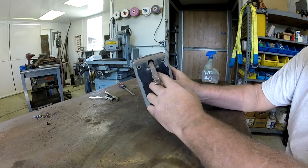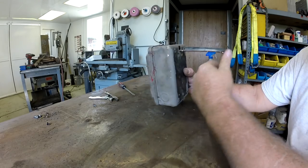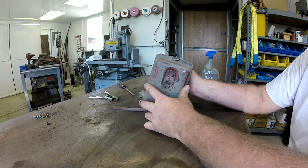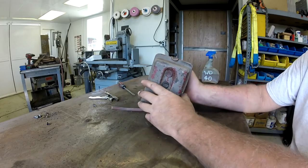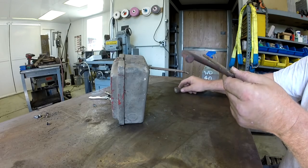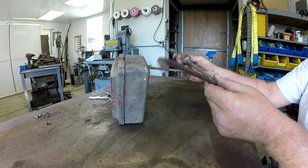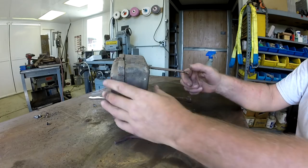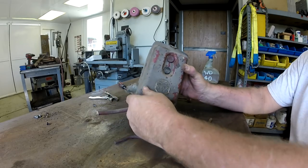They went in, they drilled a hole in the back of the enclosure, and they had this rod. What that does is, when you're in start, that'll drop out the stop button. So, press cycle start, the saw comes down. In the backside, there was this little twist rod in there. I had to cut it to get it apart. Someone welded a hex bar to it. But this rotates as the carriage comes down, hits it, rotates it, and that's what drops out your saw at the end of cycle.